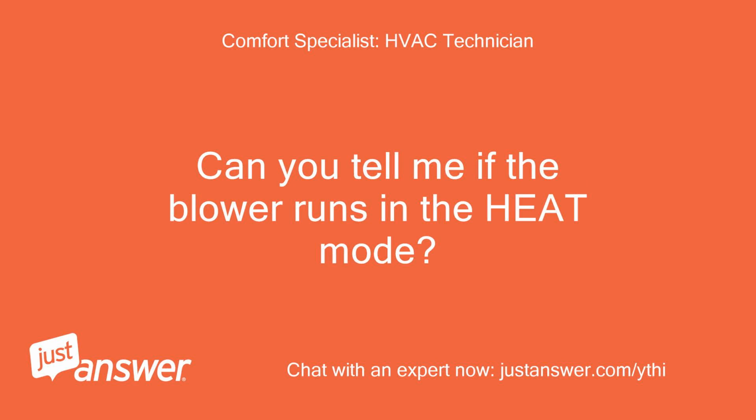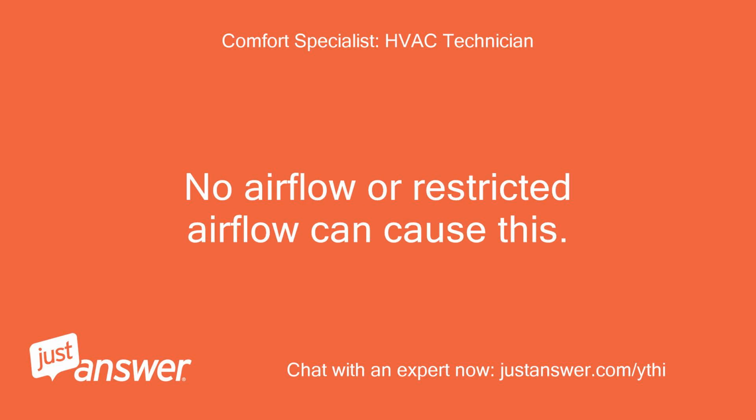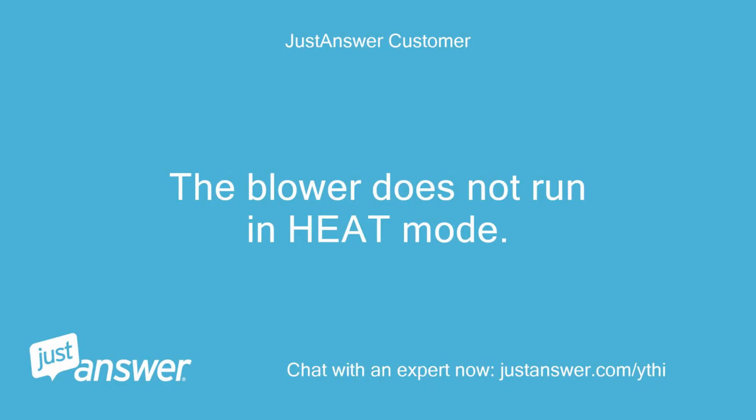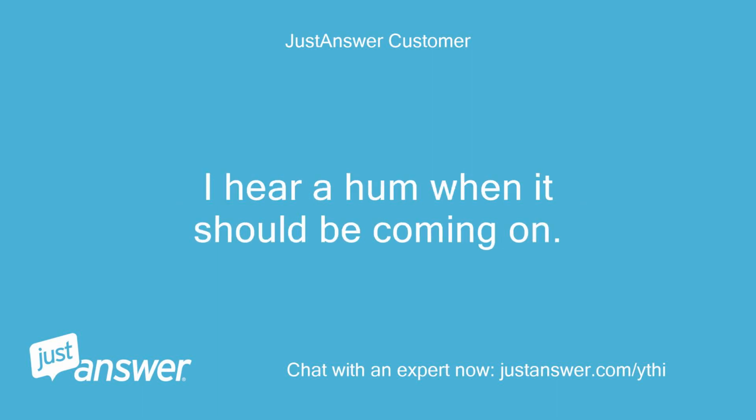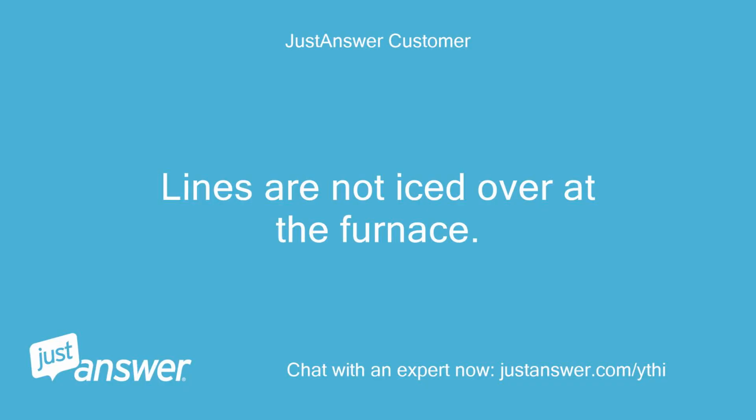Can you tell me if the blower runs in the heat mode? And the frost on the tubing is likely only due to the blower fan not running like it should. No airflow or restricted airflow can cause this. The blower does not run in heat mode. I hear a hum when it should be coming on. Is the coil still iced over in the refrigerant lines? Lines are not iced over at the furnace.